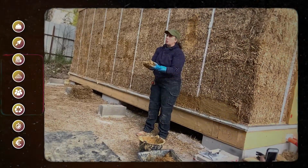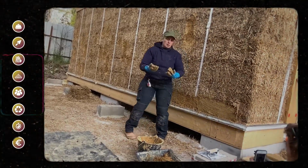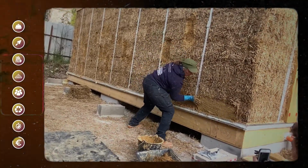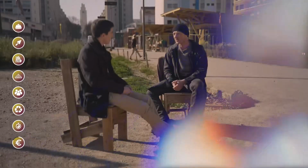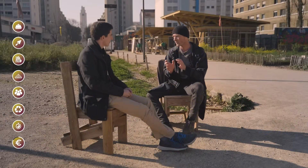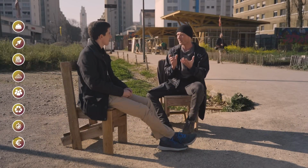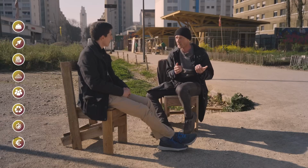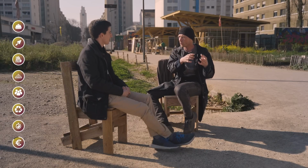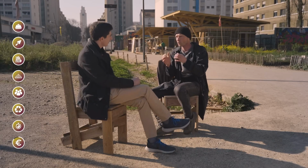Once we have the right tests and know-how, we can build ourselves and buy inexpensive materials. And in France, self-construction is legal, so we also push for that. Straw construction has structural issues not described in French texts. We want to address these when building one. For timber frames filled with straw bales, we can rely on Eurocode 5 and the DTU 31.2 for timber-frame houses. So everything is already well described everywhere.